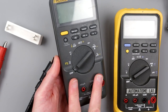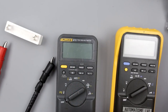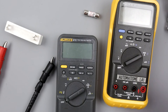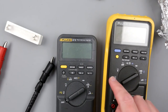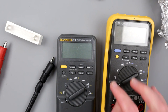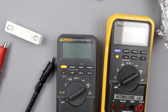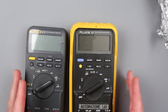Now I have to put the correct fuses into my other multimeter as well, but that won't be a separate video. The other multimeter currently has a 3-amp fuse instead of the correct 440-milliamp fuse, and a 15-amp Bussmann fuse instead of the correct 11-amp one. I did buy proper fuses for those. A 15-amp fuse is probably not the worst case scenario, and I've seen some multimeters that actually use 15-amp fuses. But I'll use the proper ones.